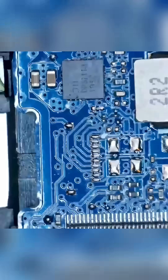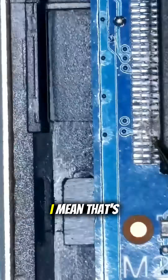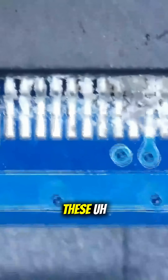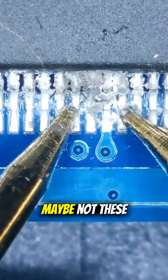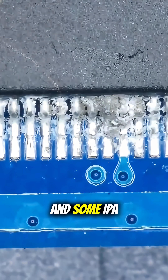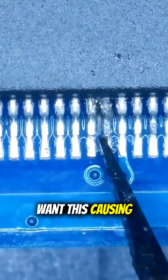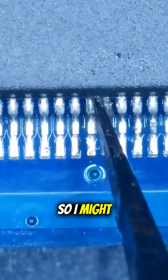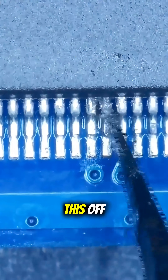Should we go over to the scope? Again, just having a visual inspection. What's that? Oh, what's this? That's corrosion. Let's just check and see if these lines are shorted. Yeah, it's all bridged — maybe not these two, but these two are. Let's give it a clean with a toothbrush and some IPA. How easy does it clean? That is the question, because in an ideal situation we obviously don't want this causing any further issues.